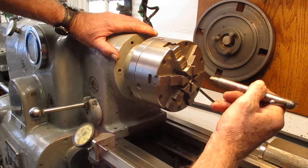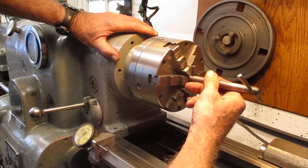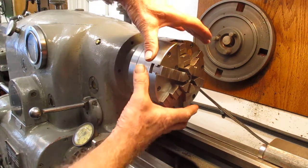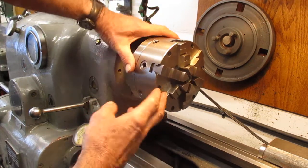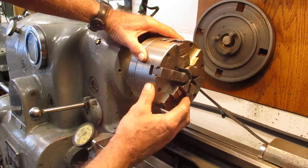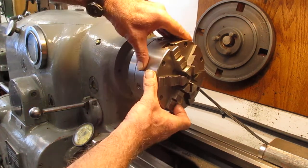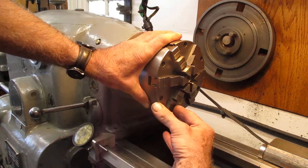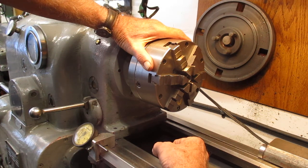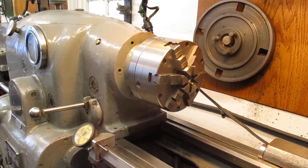Look at this — the bushing's not loose, it's stuck in there. I can kind of tap it back. What happened is the chuck expanded, because if you think about a 6-jaw chuck, the front piece is all cut away for the jaws and the shell here is thin. So this is a very poor work holder — it's absolutely worthless for high-precision work. Now that we've got that straight, I'll get back over to the other machine and talk about other chucks.